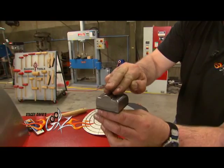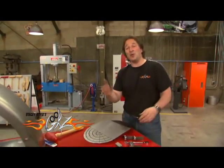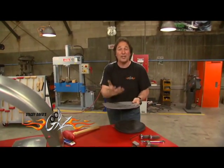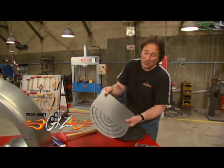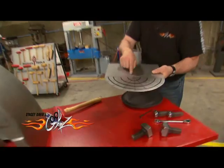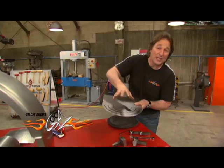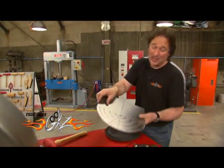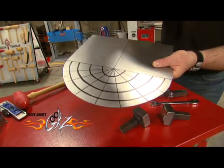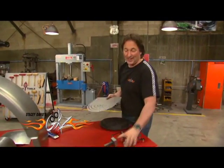See how they go together. The way it works: when you push the metal in, it bends the metal up in the center; when you pull it back, it hammers it back together and shrinks it. Anytime you're making a panel, you don't just want to go in at random — there'll be no way to control the shrinkage. What you want to do is draw out some sort of a grid like this. This grid is for a piece like the front of a fender or a gas tank that's going to come up and roll down in front. You're going to have to shrink it more on the outer edge than in the center, and the grid will help you know where you've been and how much you've shrunk it.